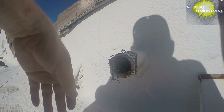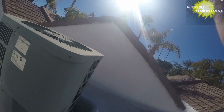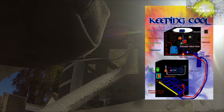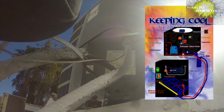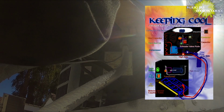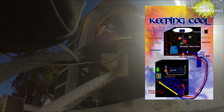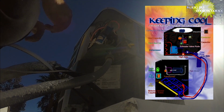Definitely hear a lot of water running. Anyway, let's take a look here. This looks like a 10 SEER Goodman unit. Now, I was using 13 SEER. Now the requirement is 14 SEER, which for me, a lot of times, all that's available is R410A for the 13 SEER. But I'm still using R22. I haven't switched over yet.